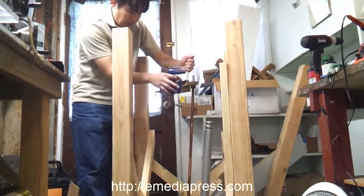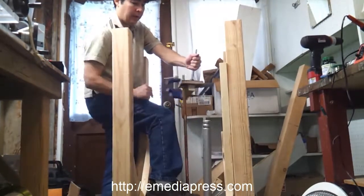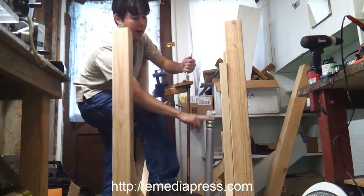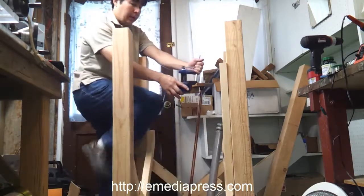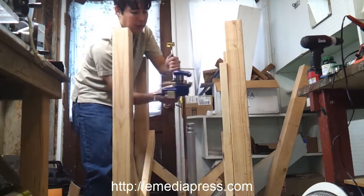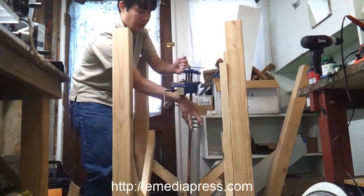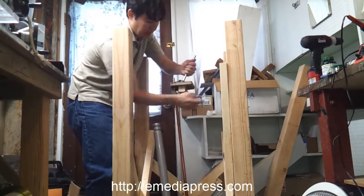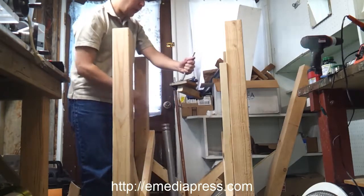Okay, so it's important to understand that the upper mechanism completely moves independent of this. When this is going around, this is not spinning this around, like I already showed you. It's gravity which is moving it to the incline. This is the lever rod here. As these are able to rotate independently of each other, they're not locked together. It's open loop, because if these are locked together and you turn this, this is going to be fixed to the position of wherever this is, and you're not going to let gravity push this towards the incline, and then you just cut gravity completely out of the process.